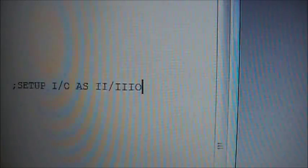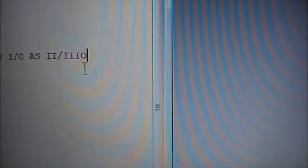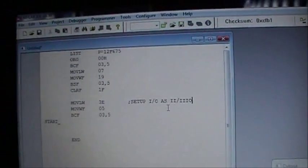What that does is it defines what my ports will be defined as. Obviously, I've got 6 to choose from, and the first 5, well, these 5 right here, will all be inputs, just so I don't have any complications. And the first port, the 0 port, will be used as output, and the rest are all input. Whew, did I explain that? I probably not. Anyhow, let me quickly show you.